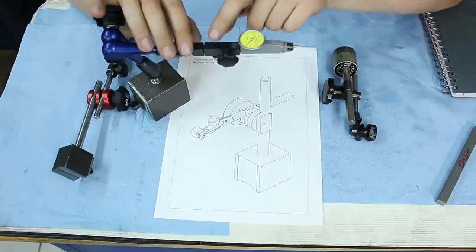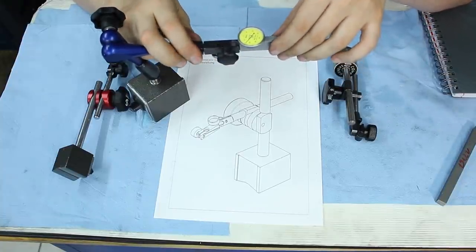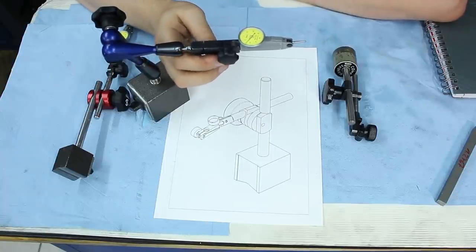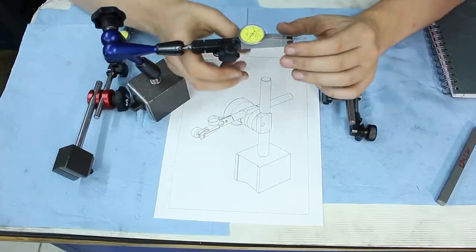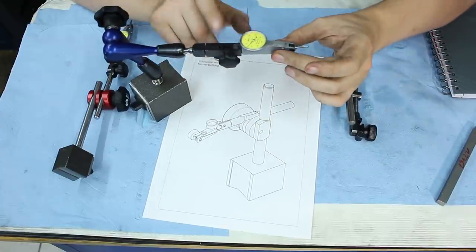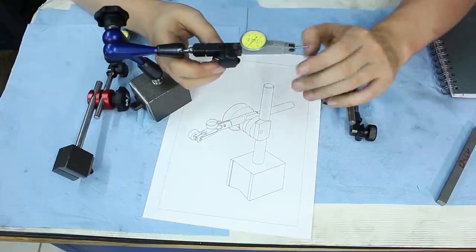And also these swivel type fine adjustments here, they have side-to-side slop. They have to have side-to-side slop, otherwise they would be rigid. There is a pretty heavy spring under it, so most of the time you will not notice the side-to-side wiggle because it gets pushed to one or the other side. But when you try to indicate something that's moving perpendicular to the fine adjustment, you will see strange effects on your dial test indicator. The measurement will jump if you change the direction, for example.